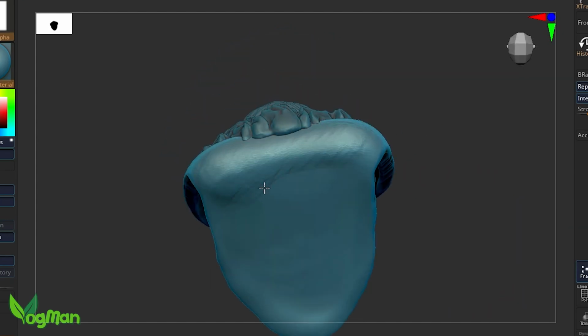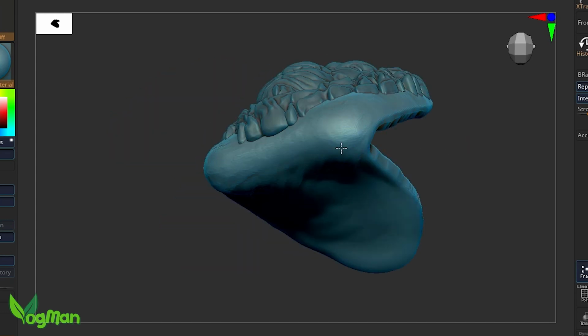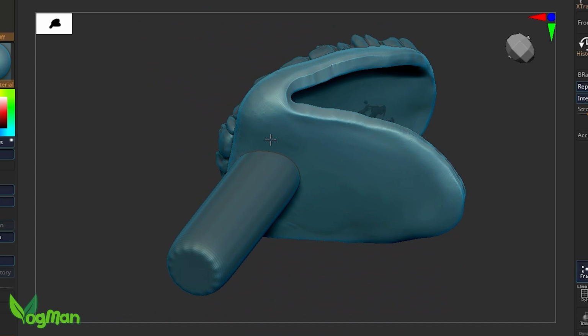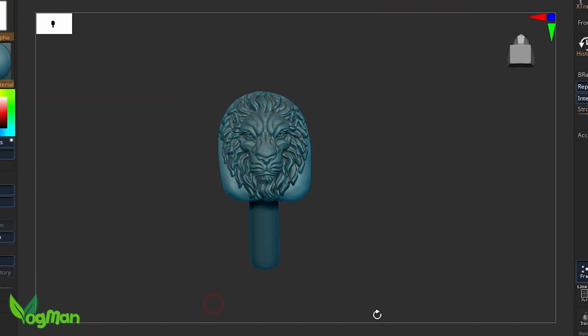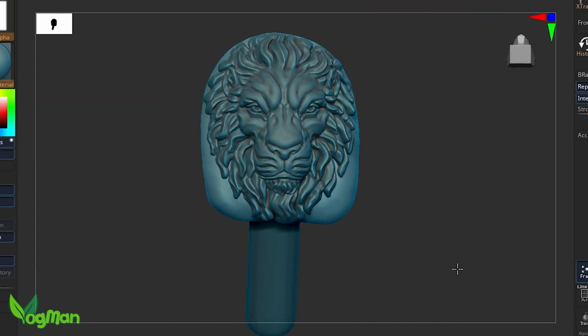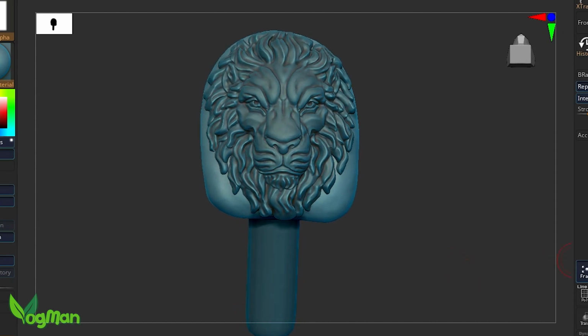I'm going to thicken the bottom area very slightly with more virtual clay, just to make metal flow that little bit easier. I also add a sprue into the design work. Finally, it's a good idea to boolean away the original teeth to ensure that we've still got a correct spacing. And there we have it. All we need to do now is print it.